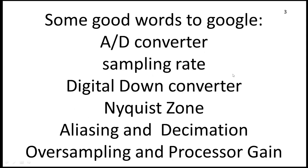When sampling an analog signal and trying to turn it into numerical digits, the minimum analog-to-digital sampling rate is normally two times the maximum frequency sampled. The sampler is two times faster than the frequency — it's called the first Nyquist zone. When sampling, many signals above and below the tuned frequency may be found to have the same set of numerical data points. These are called aliases that will make ghosts and lines in your waterfall display — like the backward wagon wheel in old film strobing Western movies.